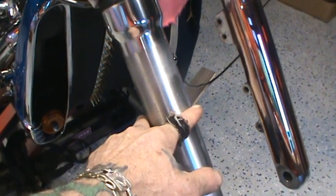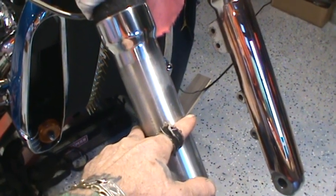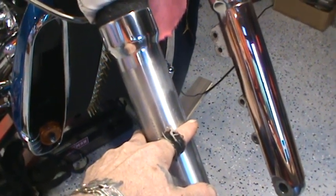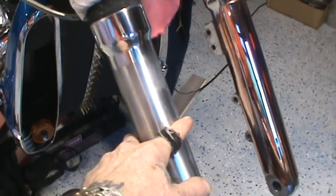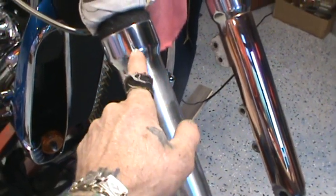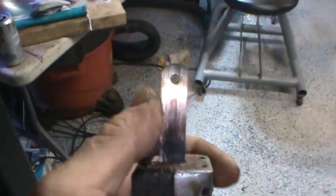So you could buy two inch inner diameter copper pipe, or you can buy two and a half inch inner diameter pipe. If I bought two and a half inch it'd be real sloppy, so I had to buy two inch — so you gotta cut it. Got the idea from Gaster's Glass: instead of buying expensive blades, you just buy good hacksaw blades and put them in there.